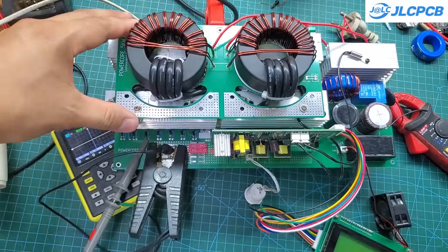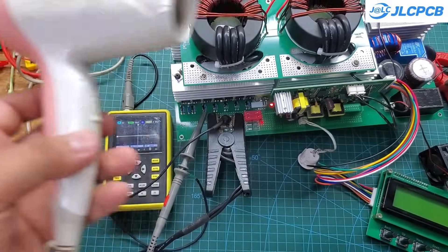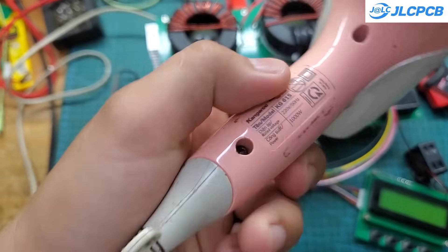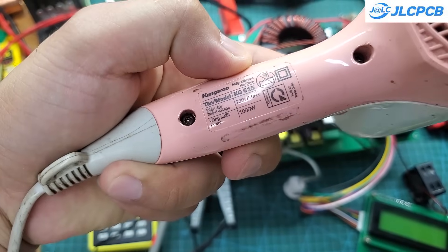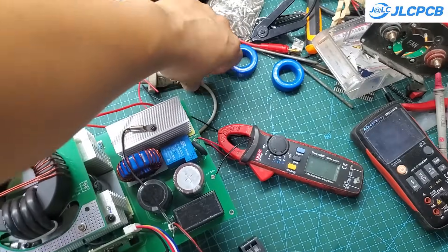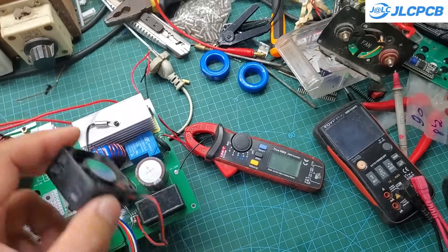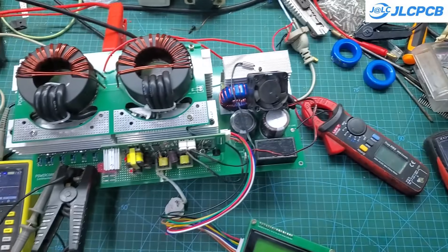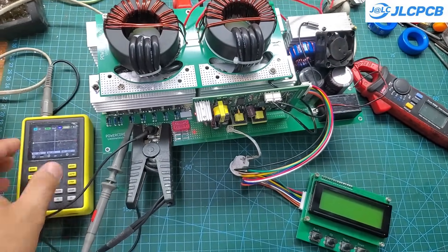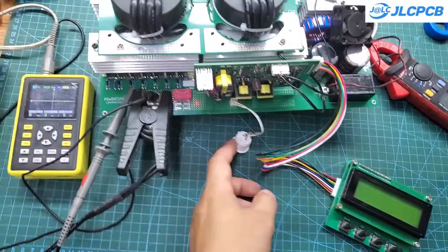Since the output power goes up to 6000 watts, I used an H-bridge structure with 28 MOSFETs. I'm using two D624 toroidal transformers in parallel. I also included a display on the output side, so the customer can freely adjust the operating parameters. Because this is a custom design for a customer, I can't share the entire project — I can only share the schematic diagram. If you want, you can contact me via Facebook and I'll send it to you.